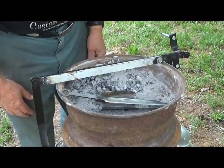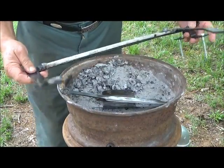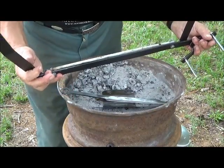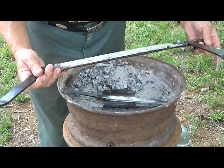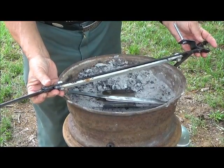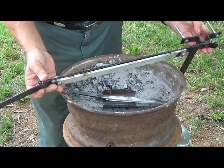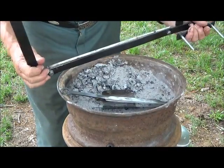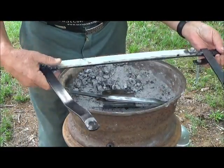What have we accomplished with our first attempt at forging? This is a piece that belongs to a disappearing stairwell, and this member here had badly bent in two different directions. So we heated it and straightened it on the anvil and reinforced it, as you see, with another piece of straight steel. Now we have all the hardware on it, drilled out for new nuts and bolts, so this is ready to install — and after two years, I get my disappearing stairwell back in working order again.